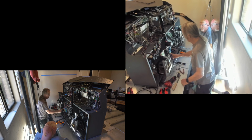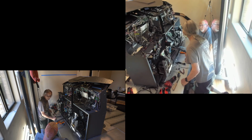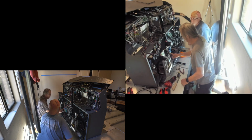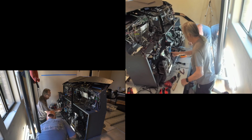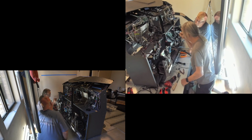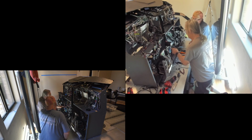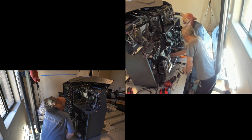But through this FlightDeck Solutions relay card. There are 8 relays. I'm using one for the Hobbs meter, which I haven't finished. My Hobbs meter will run when the engine runs. Plus, on this relay, I'll apply 24 volts to the common, and to the normally open contacts I'll hook up the shaker, and the other side is the ground right here. So we get 24 volts to here, 24 volts to the shaker, and here's the ground. That's all wired up and sitting back here ready to tie wrap.